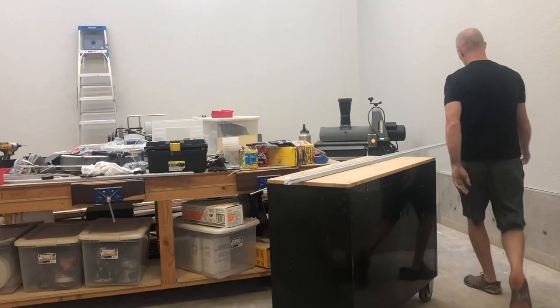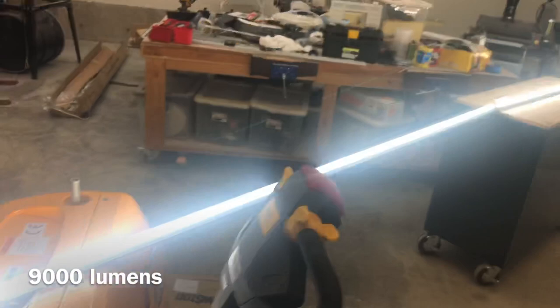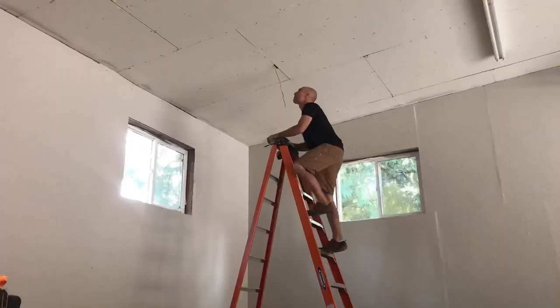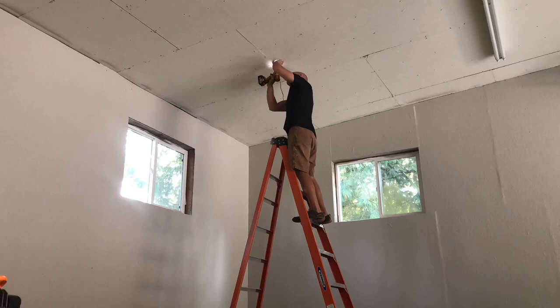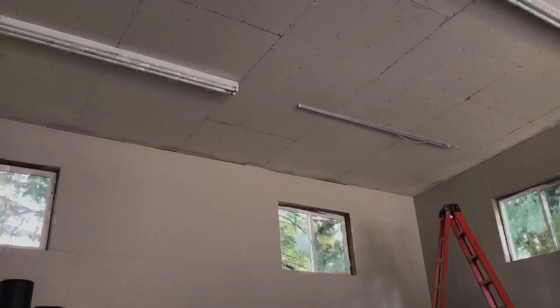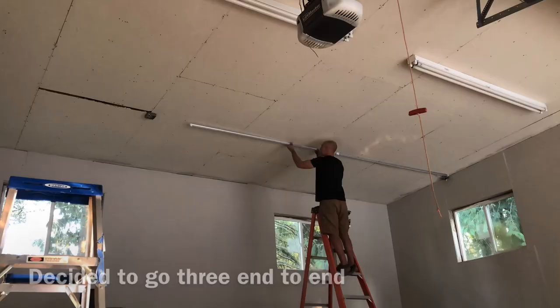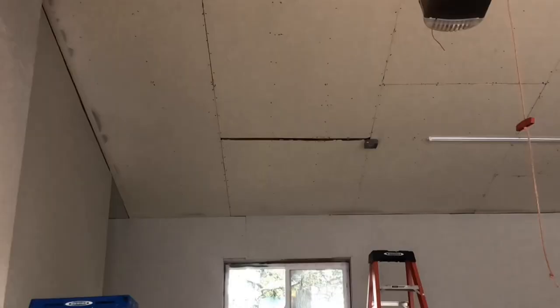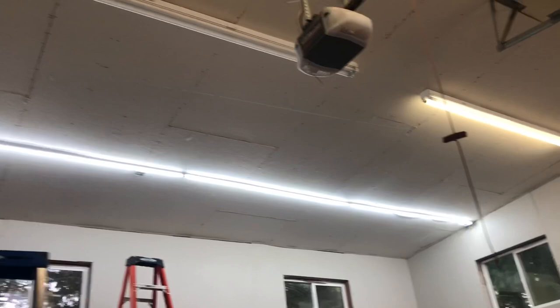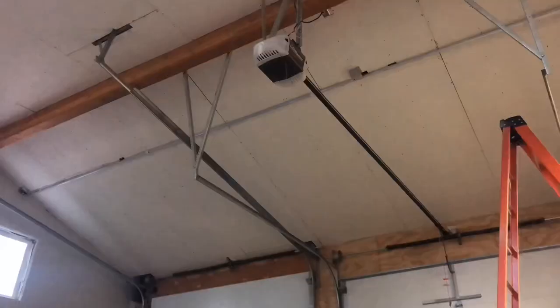Here's how they go together — it is that simple. My shop ceiling was about 24 feet 6 inches, so I could barely fit all three side by side, which actually made a pretty cool look. Once all the lights are converted to LED, they all come on at the same time with no delay. You can already see how much brighter and whiter they are, and that is what you want. You don't want yellow light in a shop — you want that in your living room. I went with 6000K, which almost starts to hint at blue light, but I think it looks great. A lot of people don't go more than 5000K; I wouldn't go less than 5000K when choosing your lights.